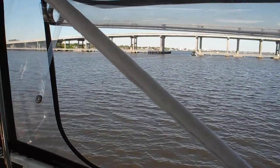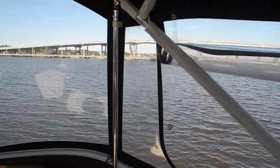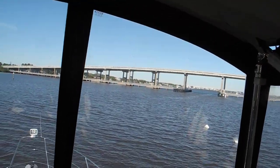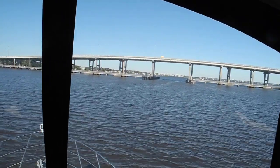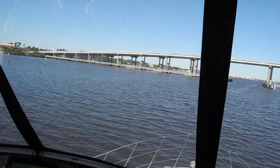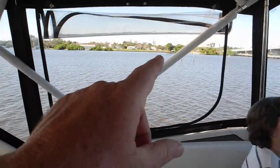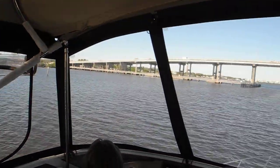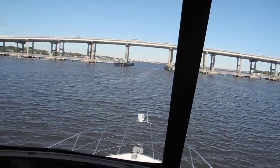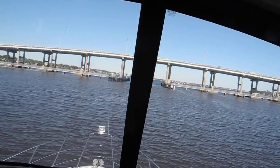Go under the bridge. 3.5 — so we're in deep water again. That's 3.5 under the propellers and the boat's 4-foot draft, so that's 7.5 feet of water. Now aim for the middle of the bridge. See the wooden bumpers on the right and the left? That shows you where the channel is. Straighten up the boat with the rudder. While we're going through this bridge, look over to the left — see those small channel markers? Small means secondary channel, large means primary channel.